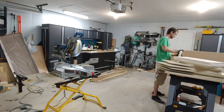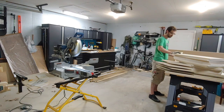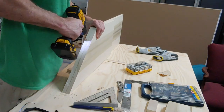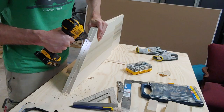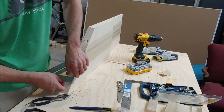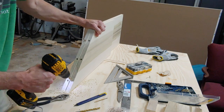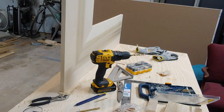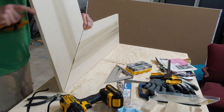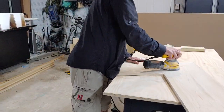It was time to make all the shelves for all three units, sanding the finishing edge on the straight shelves. We assembled the corner shelves using dowel pegs, first drilling parallel oversized holes for alignment and dry-testing along the way. The final job was done with Gorilla Glue — our adhesive of choice — along all common surfaces and down in the peg holes, with a bit of mild dampness applied, then clamps, and go. After it cured for a day, we sanded it.